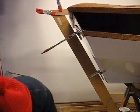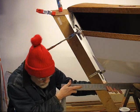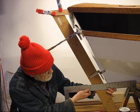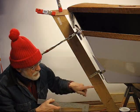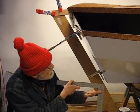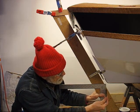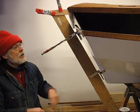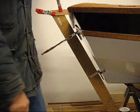This has already been done. Then I'll take my rafter square and come across the bottom of the keel line straight across and mark that. That horizontal mark gives me a vertical reference that lines up to where I want the leading edge. I'll have my mark on here, which I'll then take to my workbench and transfer over.